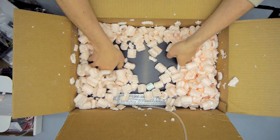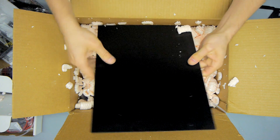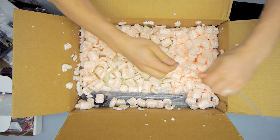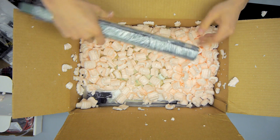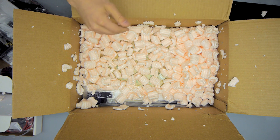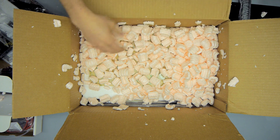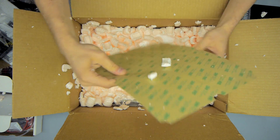The part I just took out was the Y-axis. The next part is the aluminum bed heat spreader, which is going to be the base to which the heated bed is attached. Next up are some more laser-cut parts plus the OpenBuilds rails that are going to be used for the Y-axis, and then there are some printed parts that go on the extruder assembly on the X-axis.